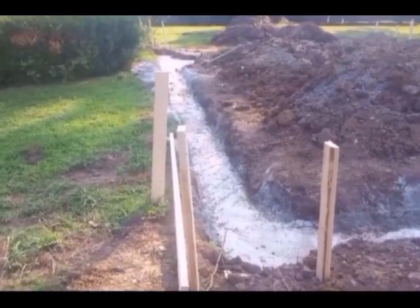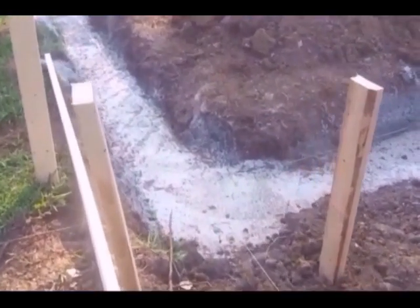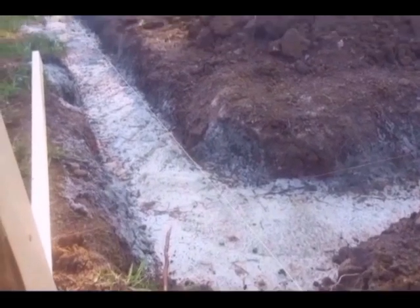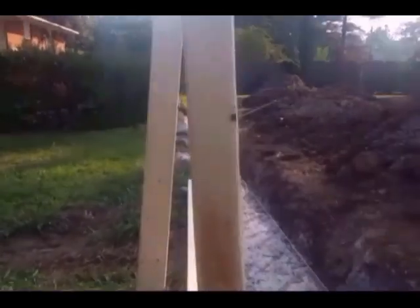So on this front right corner, the combined height of the foundation wall plus the 10-foot framing plus a 6-pitch roof has to stay 3 feet underneath the primary wire, which is the service entrance wire going into my house. And it just barely catches this front right corner, but I think I'll be good.